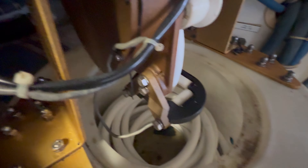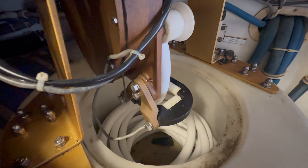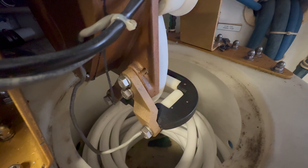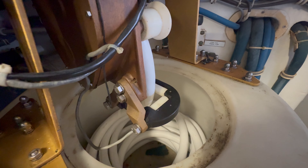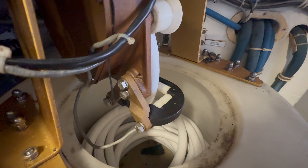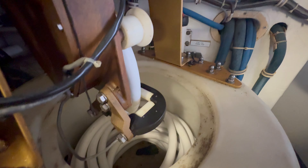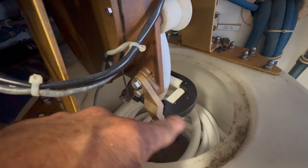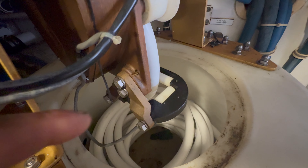You can see that I have my nice 85-foot cable inside this bucket. I like to teach the cable to come in in the order that it is actually supposed to spiral. In this particular application, the way the cable is coming in and going into the bucket from down here, I have to turn the cable clockwise on the outside coming into the hose pipe. While Julian was pressing the momentary button, I was outside turning the cable clockwise so the cable could spiral in nicely — we're teaching the cable how to come in. What we're trying to do is prevent these cables from turning into a knot, a physical nightmare. Once it becomes a knot, you have to take everything apart and put it all back in.